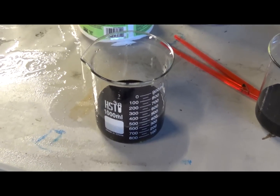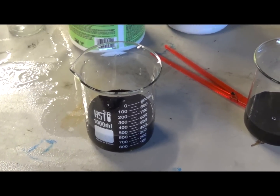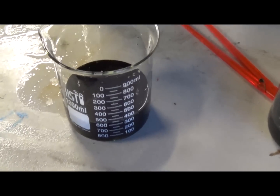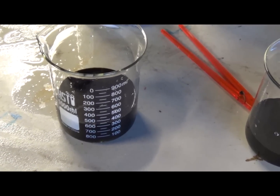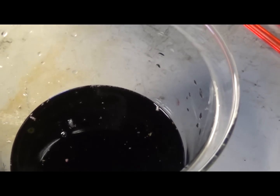The only thing you have to remember is that it takes one gallon to dissolve two pounds of base metal. So if you're going to throw in a whole bunch of silver contacts, make sure you weigh them. With the amount I threw in there, there should be enough hydrochloric to eat it up. You can see the reaction has already started — those little bubbles from the corner. So that should be done pretty quickly.